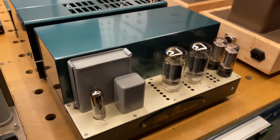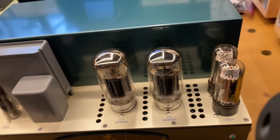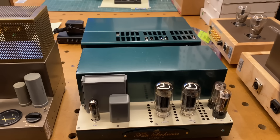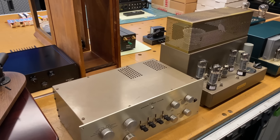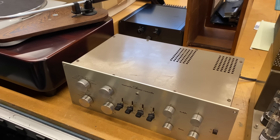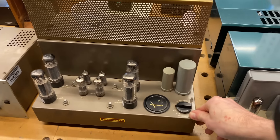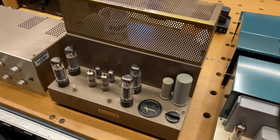I'm sure we have some Shindo fans in our viewer list. These are the Shindo F2A Sinfonia — very cool power amplifiers that use a very specific Siemens output tube. We've got these all biased up and ready, did some long-term testing, and they sound as good as they look. This is handcrafted Japanese stuff and we really like the Shindo product. And then we haven't seen 1960s Marantz in a while here. This is a Marantz 7 — not the 7T, this is the all-tube version. These have both been serviced in the past but do have some issues. We're going to do a SkyFi-style power supply rebuild on the Marantz 7, and the 8B needs a little more work — but fundamentally it's up and running and just needs an electronic restoration so it's ready for long-term use.